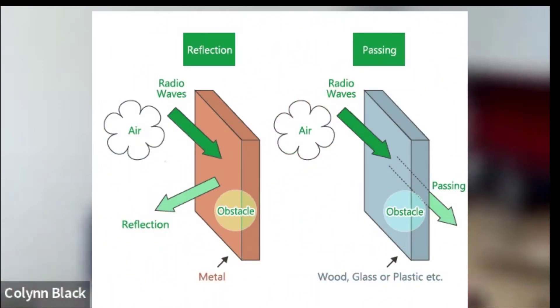This is referring to the UHF side. HF or NFC works a little differently, but some of the same principles apply from the conductive and dielectric side. When you look at metal surfaces, given the fact that the metal surface is the same metal typically as your inlay antenna — aluminum — the conductivity of that metal surface is going to reflect and prevent that RF signal from being directionalized towards the chip. You're going to get less power going towards the chip because it's getting reflected off the metal, which is why if you have an antenna flat against metal, you won't get any read at all.